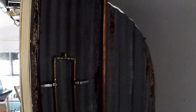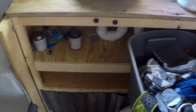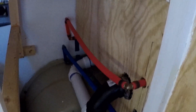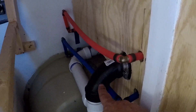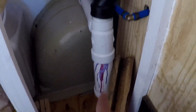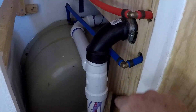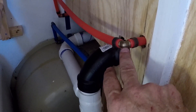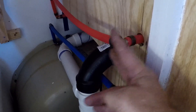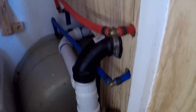Here's a little sneak peek of the bathroom so far. I've got copper piping and repurposed corrugated tin in my shower, and the composting toilet is here. I've got plumbing down here, and the sink comes down and ties into the regular plumbing behind the shower. This is the drain for the sink — the sink drain comes down and ties into the vent pipe, which then comes down and dumps into the gray water tank below the floor, and also vents to the outside. Here is the PEX piping with 45-degree elbows — you slide them in, crimp them, and it's very easy to do, though a little tricky in tight spaces.